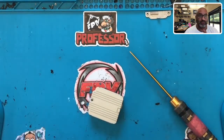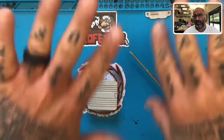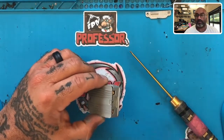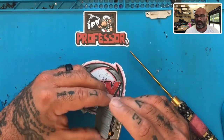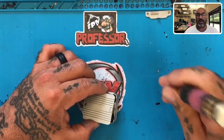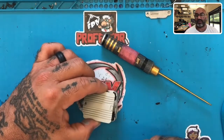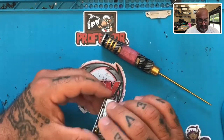Now I'll say this lightly — please don't take offense — but under normal circumstances, I would say that somebody opened the unit up, changed out one of the boards, took it from another unit, put it in here, and said hey, I've got a bad unit, let me swap some boards inside and send this back as defective. I will be pulling a log off of this to send to DJI to compare data anyway. I did run the serial number and it is under warranty at DJI. Firmware was updated but could never get the green light.